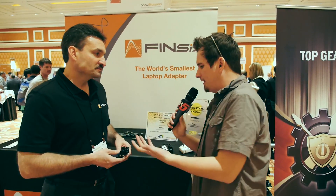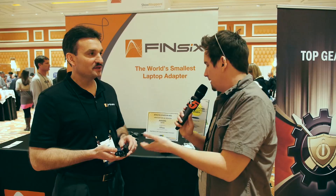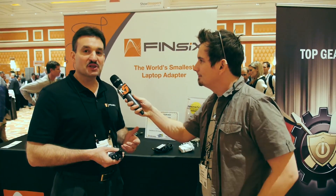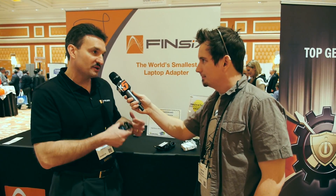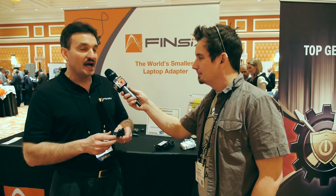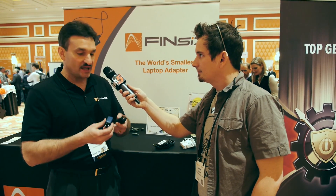So how is it that if you're able to make a switching power adapter that takes AC and gives you DC at the wattage that you need, then why are these so big? The current bricks are limited by the current power conversion technology, and they use a switching frequency of around 100 kilohertz. That means the size of the power components inside are going to be big and bulky. The way around that is to go up really high in frequency. So FinSix goes a thousand times faster to around 65 megahertz, and by doing that we're able to shrink the components to really small sizes — and this is the result.